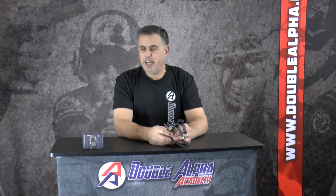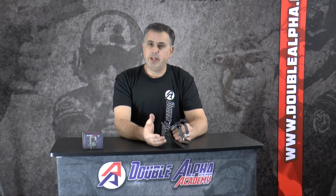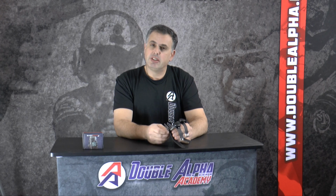The Shotmaxx 2 has been on the market since early 2017 and it has several meaningful improvements over the original Shotmaxx. The first change that we made was increasing the sound and the volume of the buzzer quite considerably. That was the number one comment that we received on the previous model. People mentioned they loved the device but they wanted it to beep louder. Difficult to achieve on such a compact shot timer, but we increased the size of the sound chamber, inserted a larger, more powerful buzzer, increased the battery capacity to support that buzzer, and increased the amount of hours you can use the timer for continuously, as well as making additional improvements to the device.